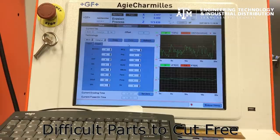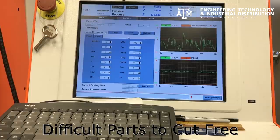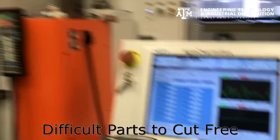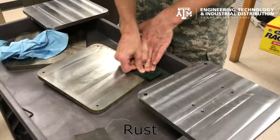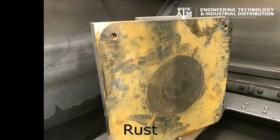Broken wires must be manually re-strung. The cutting of the supports also relieves some internal stress which causes the part to move and often break the wire. When the plate spends more time in the wire EDM, it causes rust which must be buffed from the plate later. Rust particles also contaminate the wire EDM machine filters and drastically reduce the lifespan of the filters.